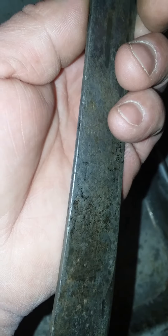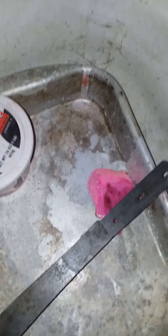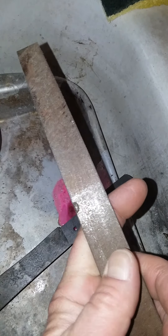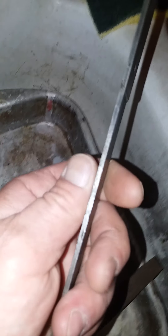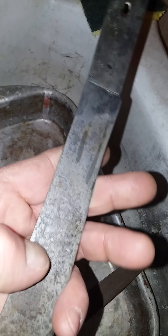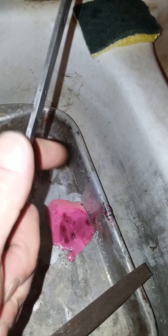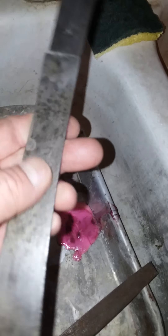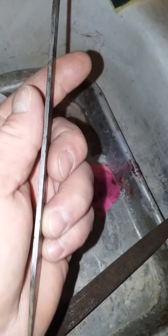Another thing I wanted to talk about: not so much the top side, because I could sand that down, but how those nicks overlap onto the blade side. I'm gonna take a file — a worn-out one so I'm not digging in too much — and file down along here to knock those burrs down so the blade part is flat. There's just enough sticking out along there. I don't mind those nicks — that's the scars of the knife, gives it character.